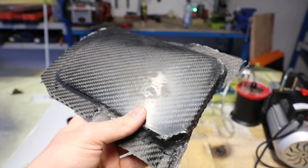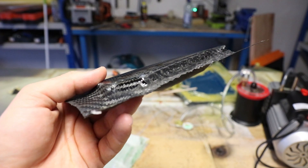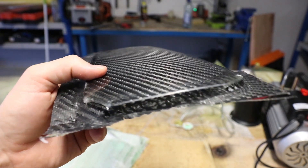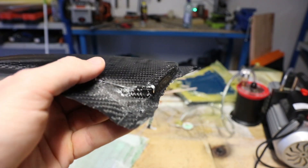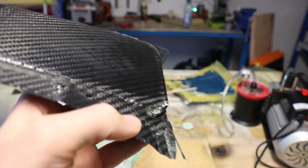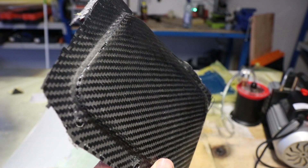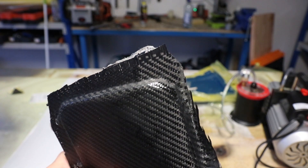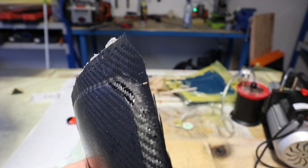So as you can see, this part's been a bit of a failure. These bits in the corners look like they just didn't quite become fully seated right in the corner of the mold. I'm left with these voids that the resin has sort of tried to fill. That corner's not too bad, but there's also this bit here where the resin has delaminated off the carbon fiber.